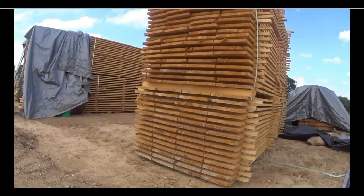The blue stain is a natural fungus that starts to attack the wood. Once the wood is dry, that fungus stops its attack because it no longer has anything to eat. As long as the wood gets dry, there's nothing to worry about — it's when it stays wet that you have problems with fungus and mold.